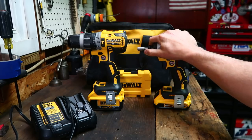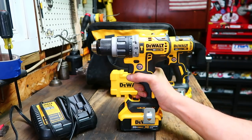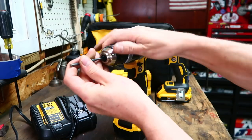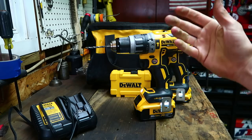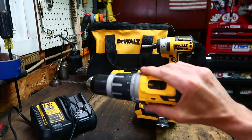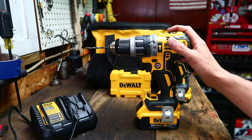I've completely put my other tools away for the time being and been using these exclusively. The drill has a really neat feature that — whoever the DeWalt engineer is that came up with this — deserves a little bit of a raise. I'll get to that in a second. This does have hammer drill function where you put your carbide-tipped bit in there. I do really like the chucks on this too. Hammer drill is not something I use typically — if you were in a pinch and needed one hole it would work fine, but at my company we all use cordless SDS's. It does not have a place for a side handle, and I think the hammer drill feature on a half-inch drill is becoming less popular because of cordless rotary hammers.